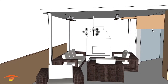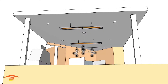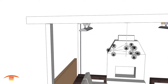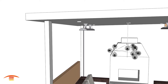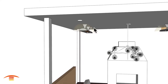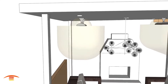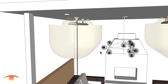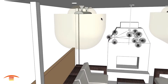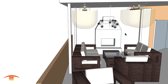You can see here that I have the two units centered between these lights, and I have it at the OEM bracket with six inches of clearance above. If it's aluminum I would still keep the clearance to aluminum, because aluminum does warp under heat and you'd want to make sure you're not warping the unit. I would go with the full clearance even though it's non-combustible. The clearance below — that's why I need that dimension below the lamp — I need 18 inches from this edge to any combustible, and I don't want to penetrate the light fixture with any of the heat ray.